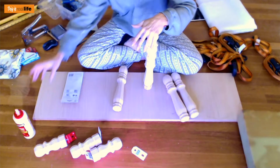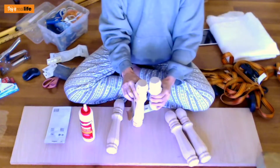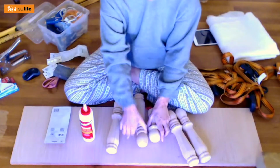I do have my Titebond wood glue, not sponsored, and I do have a little bit of sandpaper because while the bottoms of these aren't entirely super smooth, I do wanna rough them up a little bit just to give them a tooth for the wood glue to help it be a stronger bond. So I am going to sand the bottom of each of these and then we're gonna wood glue them together and put them off to the side to dry.